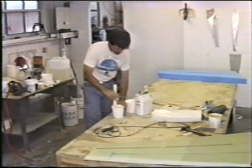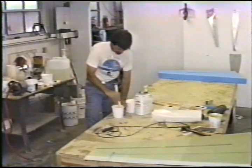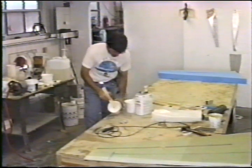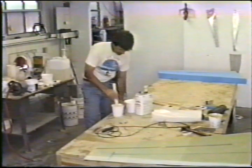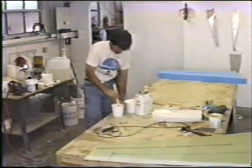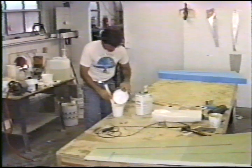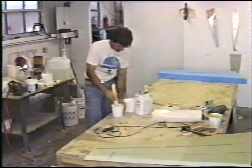The 205 hardener is pretty fast stuff, so you don't want to dally with this. If you're mixing, make sure you have a well-ventilated room. Stuff likes to float. Now I want you to notice that I'm using this very, very white filler. It's very pleasing to the eye. We're going to be using a material that's made of phenolic, that's lighter and is easier to sand. I'll be providing you with ample examples of how to mix this material in our upcoming videotapes.